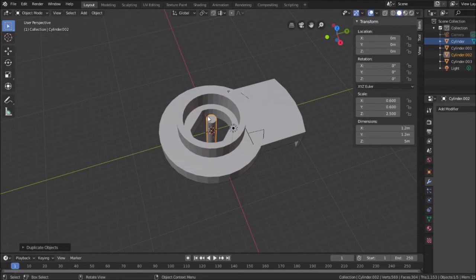So I actually have two objects over the same volume of space here. So if it's 14.2 millimeters from the outside edge of the pin over here to the outside of the edge of the pin over here, that means I need to take half the diameter, 0.6 millimeters, and then subtract that from the overall distance between the outside edges, which is 14.2. 0.7. Okay, so I only need to move it, actually it's 13 millimeters of space, because I got to account for each one, and half of 13 is 6.5. So I think if I move these each 6.5 in different directions on the x-axis, 6.5. Did I get that right?